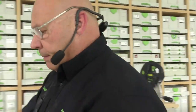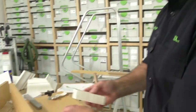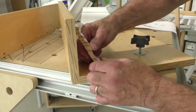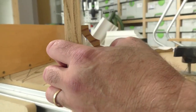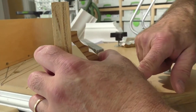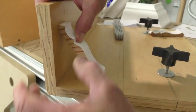I always cut a small piece off like this, and I take a measurement. Okay, this is going to be my wall, and that's my ceiling. I'm going to put my flat and flat just like this. I'm going to hold it, and I'm going to scribe a line. I did already. See that? Okay. Yep. Now, here's something I'm going to show you.